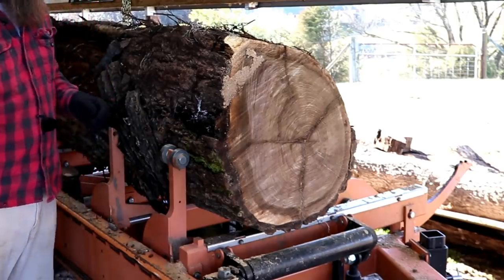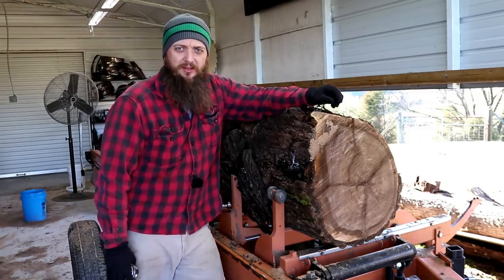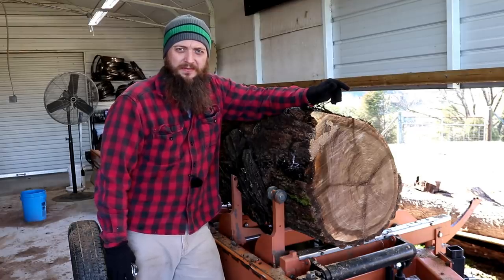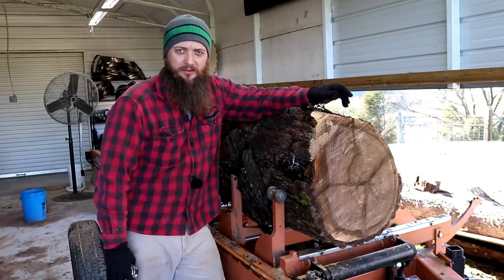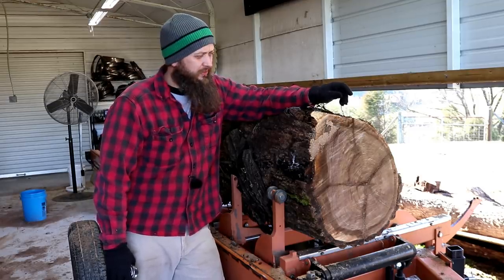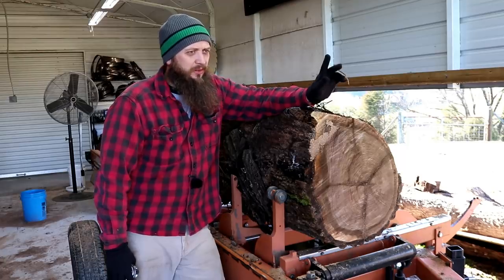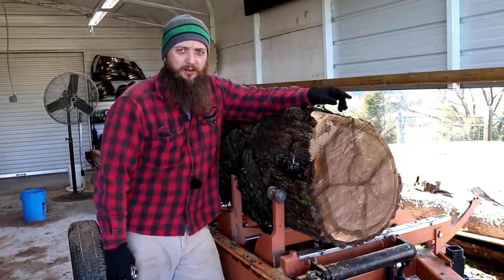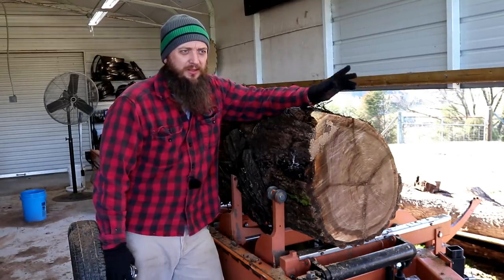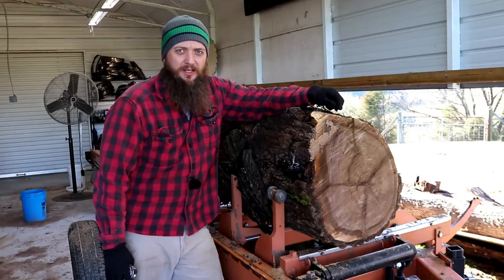Looks pretty good. Real quick here before we get started, I'm gonna try to saw this at 9/4 for slabs. And I may have to make one or two mantles out of the bottom of it because of the crack. I'm not sure what it's gonna look like when I open it up. Be a lot of troubleshooting today on this. And we're also using the number 4-degree double hard Wood-Mizer blade. That's the blade we started with on that last video, and I got about 3 cuts out of it. It's still on the mill, so we'll be using that today.